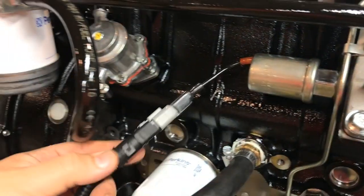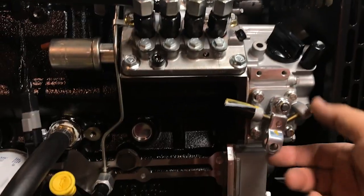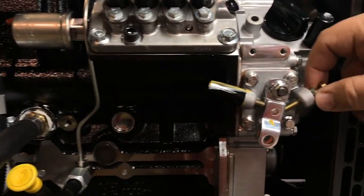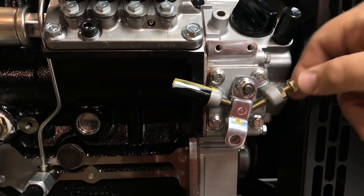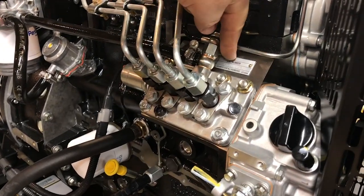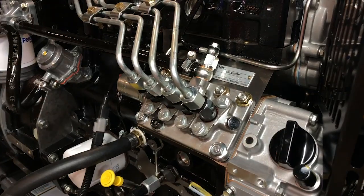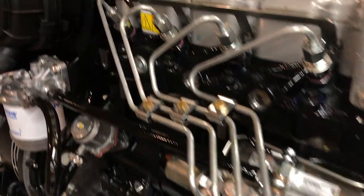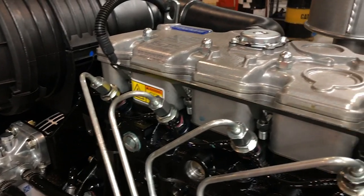This cable is for the fuel stop solenoid. To adjust the engine RPM, you can make small adjustments to the speed by adjusting the screw here. On the top of the fuel injection pump is a name plate — this is where you'll find the engine serial number and the engine build number. You'll need this information if you ever wish to order parts for the generator.